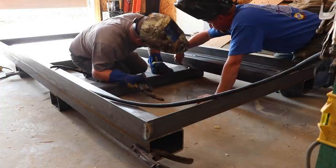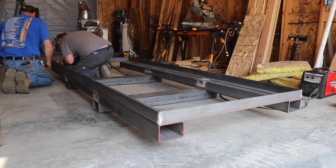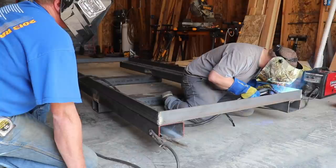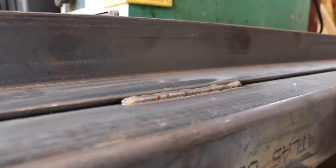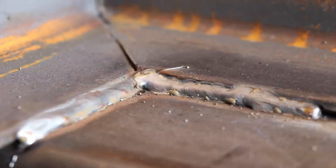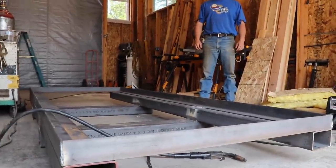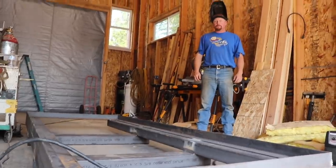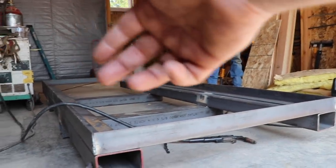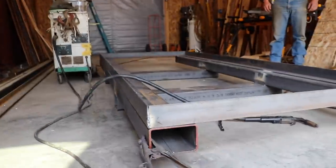Move faster horizontally but you've got to keep that puddle going. I feel like this is going a lot better — the welder makes a lot of sense and having your guidance is great. Right now we're going to weld these corners, so Justin's going to show me how to do a back weld to fill that corner from my fantastically beautiful chop saw work, and how to fill these outside corners and make everything nice and tidy.